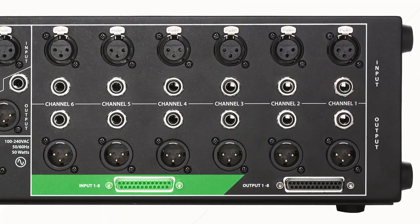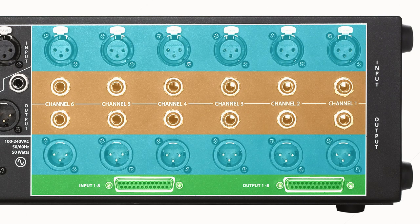You're going to need some cables and depending on the rack you're using and the other gear you're going to need either DB25s, XLR, or quarter inch TRS balanced. For this example we're going to be using XLRs. Make sure you plug the XLR male into the right input on the back of your 500 series rack and then take another XLR cable from the output and that will either feed a mixer, an interface, or another piece of gear.